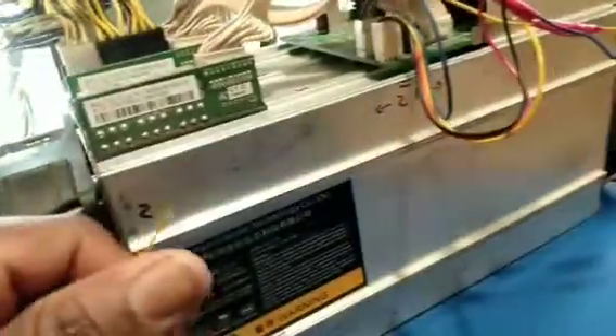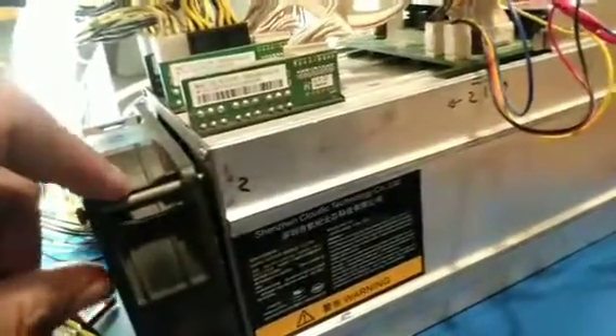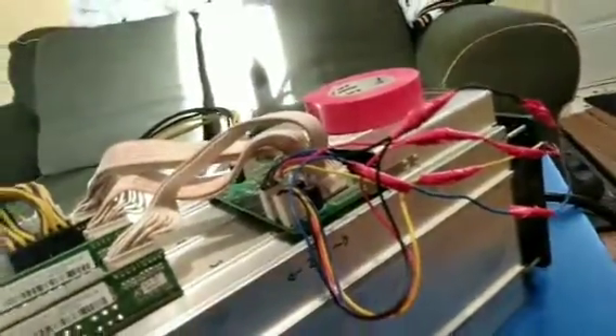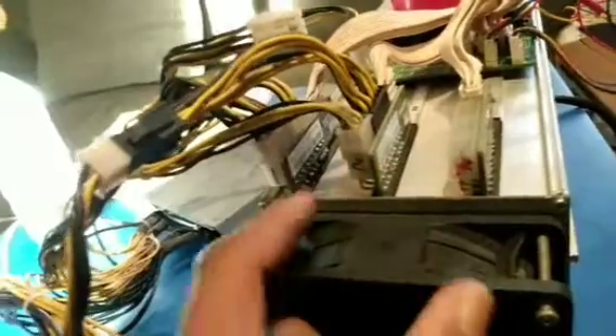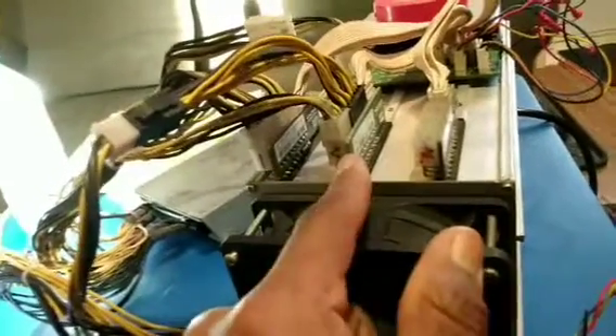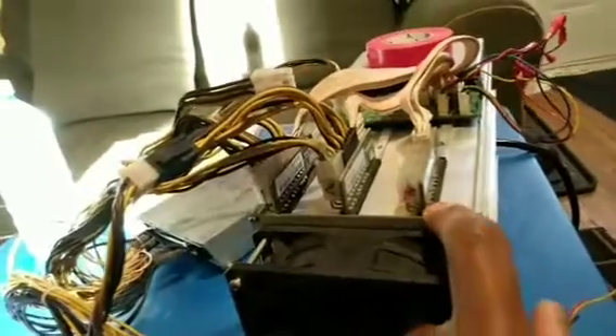So the computer system — the two fans are connected, so it's not going to give me a default light. Basically I'm going to take this out and put the duct pipe on this end to give me the cool air and blow it there. One thing I'm going to do too — as you know this is a defective one, one of the boards is defective — so I'm going to track the temperature to make sure it's not too high with one fan. I'm going to take board number one and number two and put number two at the place of number three so they are kind of separated apart.